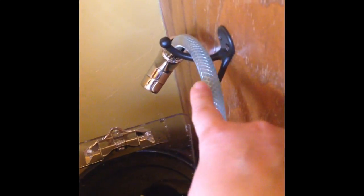Here's what my diaper sprayer looks like all hooked up. You can buy handles to attach them to your toilet, but I just installed one of these little hooks I got at Lowe's. Here's where the ball valve is so I can turn the water on and off. I put some electrical tape around it to keep it from scratching the porcelain. In the back it hooks to the toilet and to the wall, and the sprayer comes out this way. One note: for my toilet I used a 16-inch connector, but at my mother's house it needed a 20-inch — so measure for your own toilet.